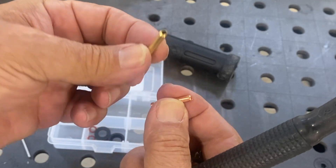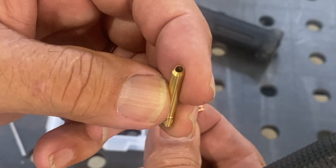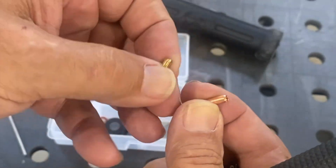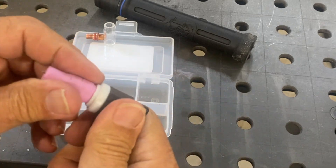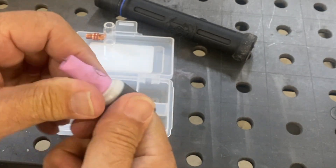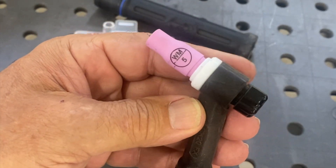This kit comes with both split collet and wedge collet. The wedge collet really comes in handy if you're using a number nine air-cooled torch because it withstands heat a lot better. Either way will work with this water-cooled torch. This is a low profile setup and gets into a lot of tight spots. Works great for a lot of aluminum applications.